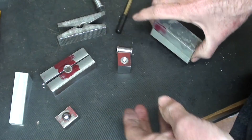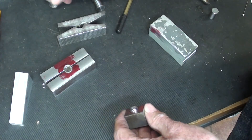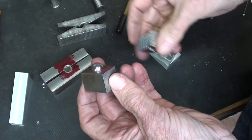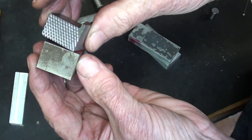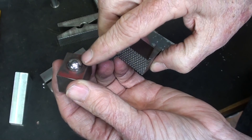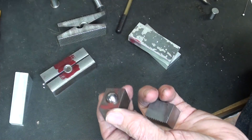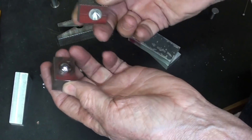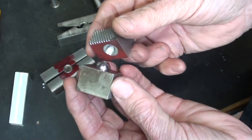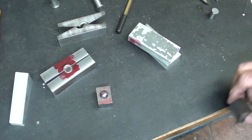So I'm going to make the ball version now, which will be a useless mock-up without teeth, but with angles. I'm going to put a ball in there — held in by Loctite — half-inch ball. That will be done with a ball end mill. Let me get this marked and I'll see you over at the Bridgeport.